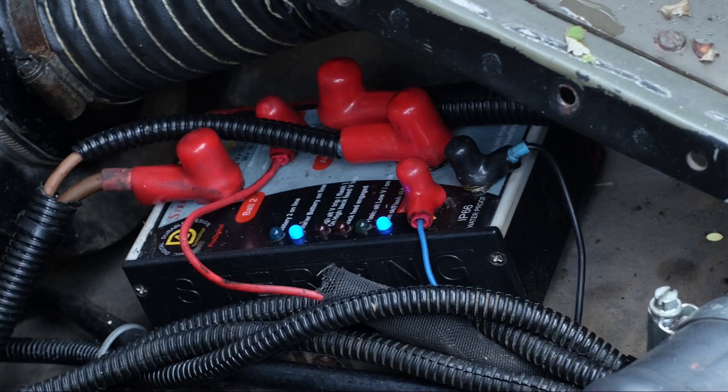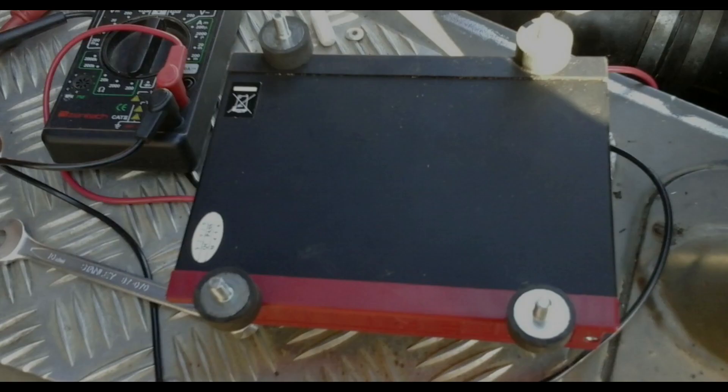There's no room inside the battery compartment for any other items, so I've had to mount it under the wing. It's always very cool there so it's not going to overheat. Furthermore, I always mount any electronics on anti-vibration mountings because they don't like vibrations. This should give excellent charge performance and I think it should be reliable too.